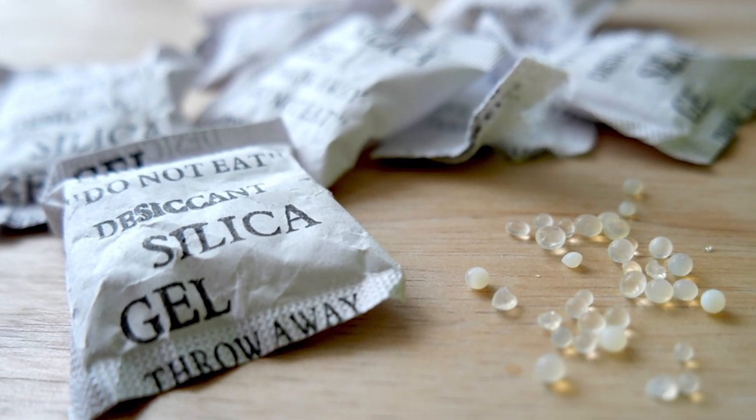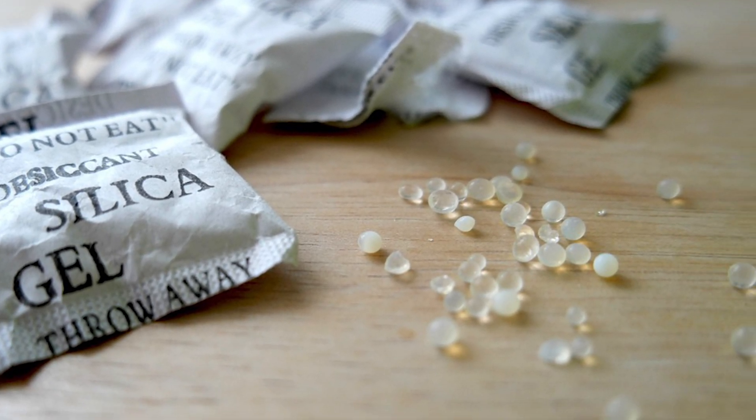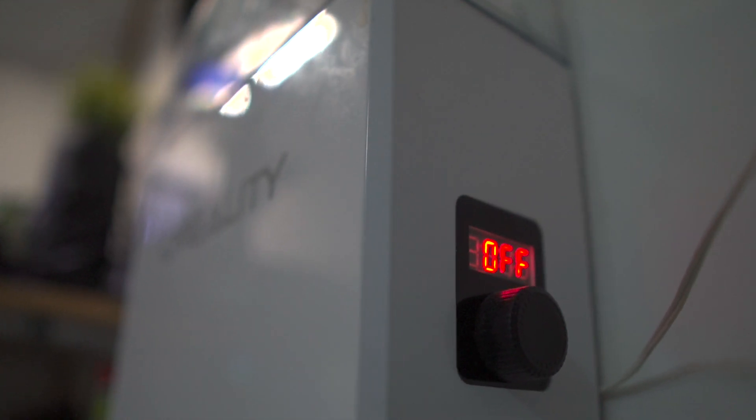This is a relatively simple fix — you just need to make sure your filament is dry. That can be done by storing your filament properly in a dedicated humidity-controlled container with desiccant — those little bead packets that come with shoes. The other option is drying your filament before printing using a dedicated filament dry box, or alternatively your oven if your wife doesn't kill you.